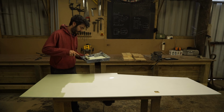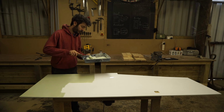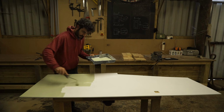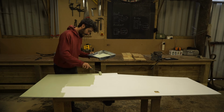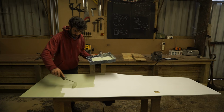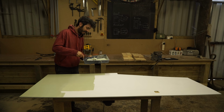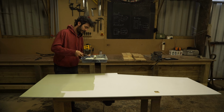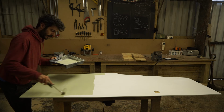Because the person I bought it from never mentioned it. Anyway, it's cross-threaded and it actually pulled some threads off. Once I'd noticed, I tried to put it back on straight and sort it out, and ended up pulling the first couple of threads off. So I did actually file down to good threads on the collet holder, but in doing that, now when you have the collet in the chuck, the nut no longer reaches the threads because the collet holds the nut a bit higher.